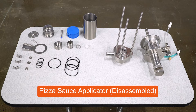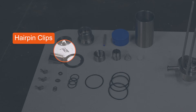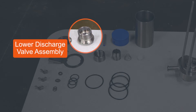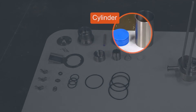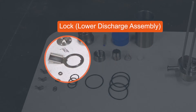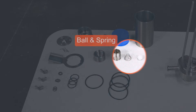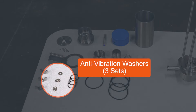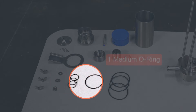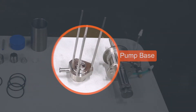Here's the pump disassembled and here are all the parts. You have the flow diverter, the hairpin clips, the lower discharge valve assembly, the pin, the piston, the cylinder, and the lock for the lower discharge assembly. You have the cap, the housing for the ball and spring housing and cap, the three wing nuts, your anti-vibration washers — there are three sets. You have three o-rings this size, one oddball size, and three at the larger size. You also have your pump base and then your air cylinder.